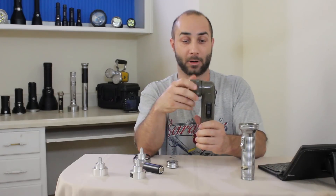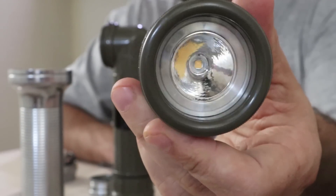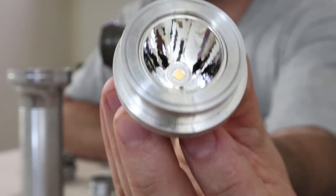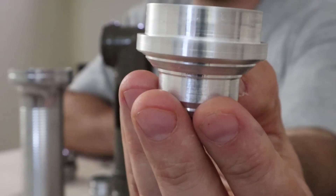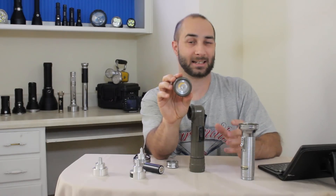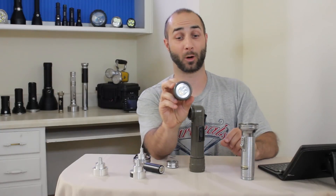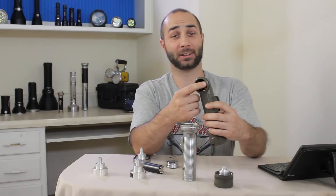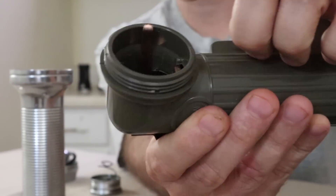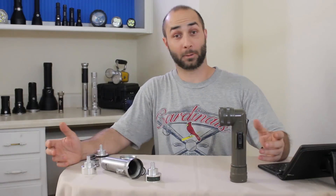For the plastic one I did pretty much the same thing — I filled in the extra space around the bulb from the triple, since they only wanted a single LED. The requirements were 250 lumens, single mode, and one LED, keeping it looking as original as possible. That made it tough to hit the lumen output since it's not a very efficient way to power a light engine with just one LED. But we managed to squeak out exactly what they were looking for. When it came to it, those are some tremendous copper contacts — bigger than anything you see in a high-power flashlight most of the time. I sleeved this one similarly so it's also powered by a single 26650.